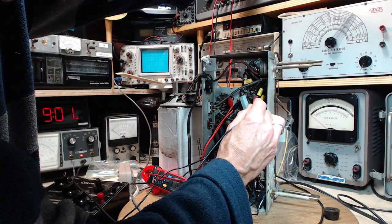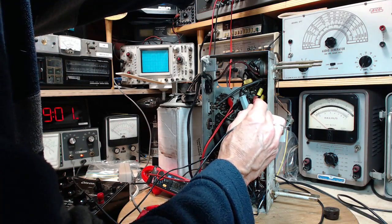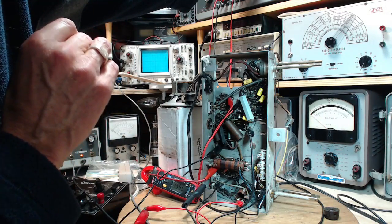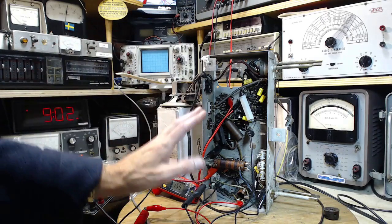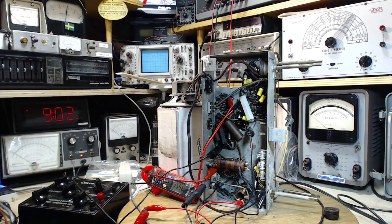So it's at 9 now. 7, 9. That's not bad. It goes up over 10. I'll take that out of there before I make a short circuit by accident. I think it's okay. I think what we got is a fairly low... We got a strong bias, gives us a low quiescent current through the tube.